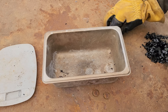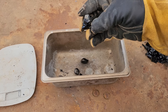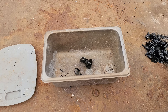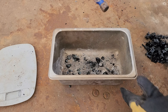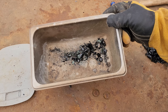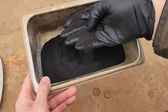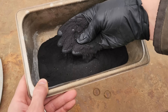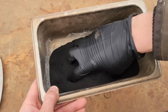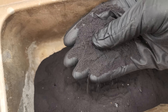Now what I've seen in the past, which is kind of unusual - and I'm hoping someone out there can tell me what is going on here - is if I break up this mat and come back in the morning, it'll be like a black powder. So there's the mat all broken up. I'm going to come back in a couple of days and show you what happens to it. And here's what happened - I added a couple more smelts of the same stuff and crushed it up, and it just turns into this black powder. Super super fine. I don't know if the water in the air hydrates the sulfides, or if they oxidize, or what exactly happens. But the sulfides just fall apart and become a powder.